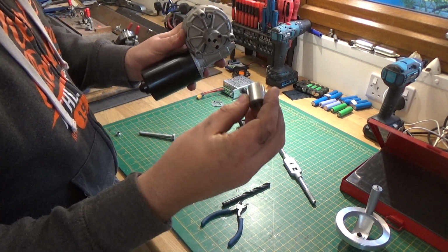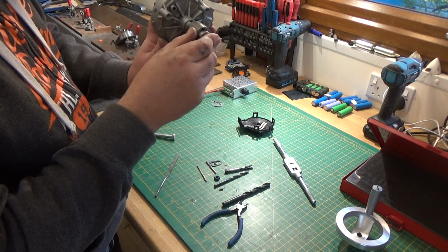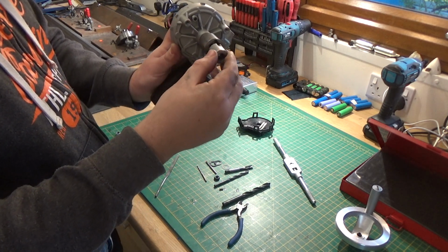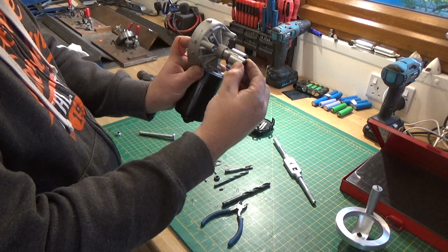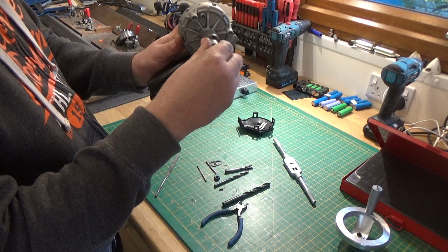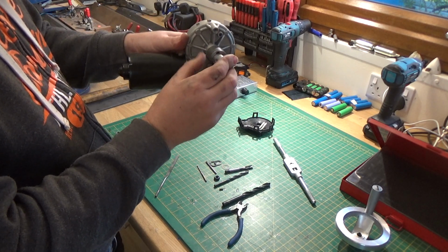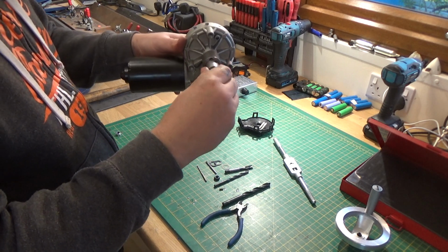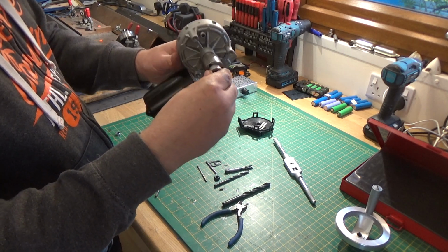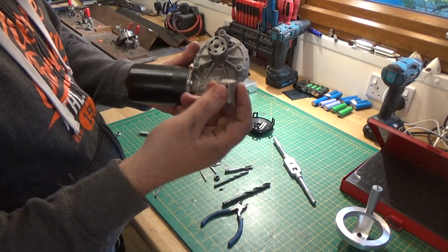And when that's on the mill, that comes lined up, you can knock the pin across and it'll only go to about there, which should be 50-50 of the collar. So those two, basically, when it's like that, they will run round no problems. So you can wind the handle from the other end and do what you need to do. Then that comes across, locks it, then you can use the feedway. That's the plan. It's looking good so far.